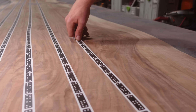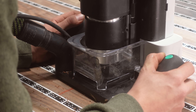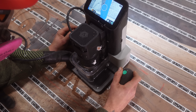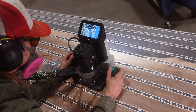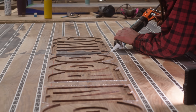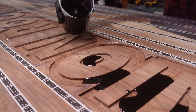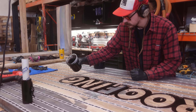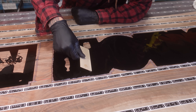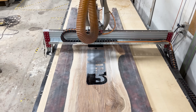This table has a lot of different things than we usually do. Since it's a conference table, the client wants their company logo engraved right into the center. To achieve the perfect design for the client's logo, we had to perform this in two stages. Randy is using our Shaper router to mill out for the initial pour — the first color is a black resin, which will be the outside shadow line outlining the text. After that cures, we'll add the red. Technically this pour could have been done with our coat thin resin, rated for quarter-inch thick pours, but to get the strongest bond possible we opt to use our deep resin. It delays the process — we have to wait one week for this resin to cure — but the deep resin allows it to soak into the pores of the wood almost like rebar in concrete, forming a much more permanent bond.